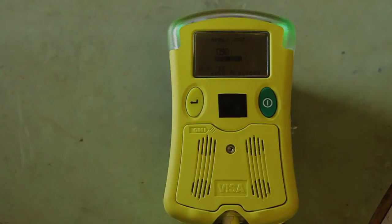Every gas cylinder will give you an accuracy reading. So when we are calibrating this particular unit to this particular cylinder, we have an accuracy rating of 5%. On the CO, we have not reached the 100 parts per million. So we will show you another step for when this occurs in the field, or in the office, wherever you're calibrating this. We will show you how to bump this to the 100 parts per million.